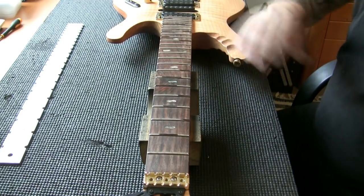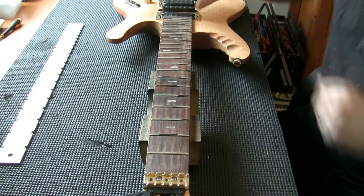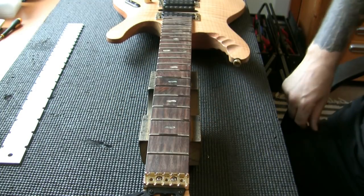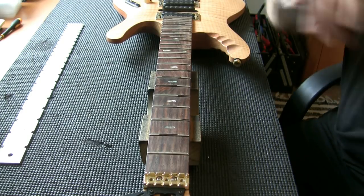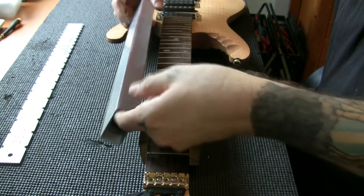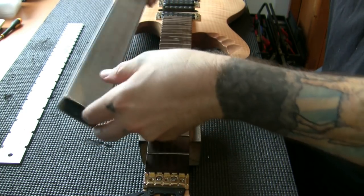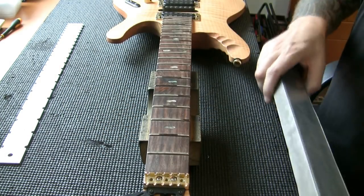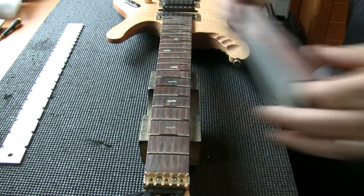So it's going to be over on the neck jig, far side of the room. I will tape up the whole fingerboard and skim across with a leveling beam, one I made myself. A few of you have seen this before. This is machined flat, both edges milled flat. I have 400 grit one side, 240 grit this side, 400 grit that side. I'll remove the main with the 240, then I'll smooth off with the 400.